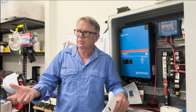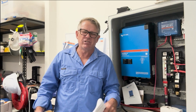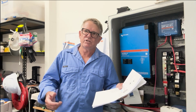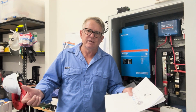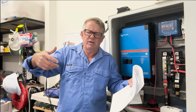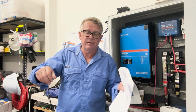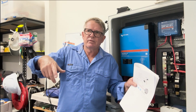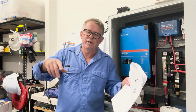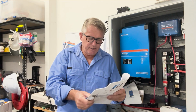And what do I need for that? Special tooling. How am I going to cut a chain? Angle grinder. I'm not going to carry an angle grinder on my boat. Bugger that. So I went to a Sav winch. The Sav winch has rope and chain. So 10 meters of chain up to the anchor, and then it's got rope. It's nylon, it's a special, I don't know, we'll have a look at that later. 200 meters of rope to the winch itself, and I think there's more chain. But, you know, they take that into consideration.